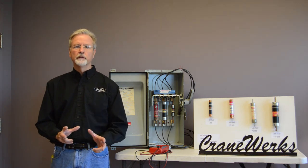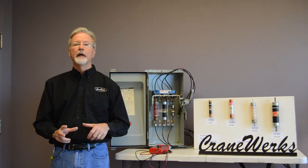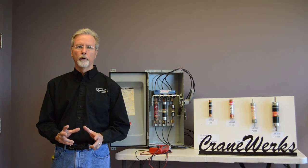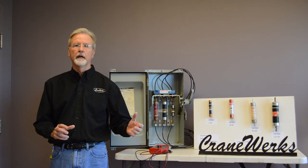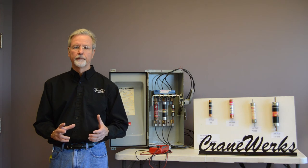that you're not able to determine what it is because it's not causing the problem at this time, and that if it becomes a nuisance, you may have to start changing some components for them in the future, starting with the most likely component that's bad, wiring, festooning, something like that, and then working your way through the system until you get the nuisance to clear.